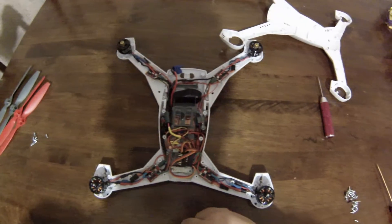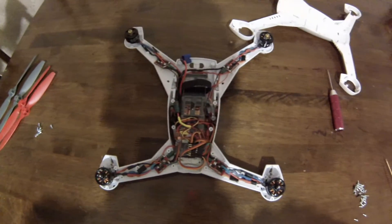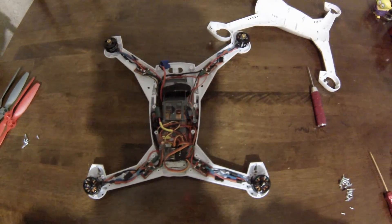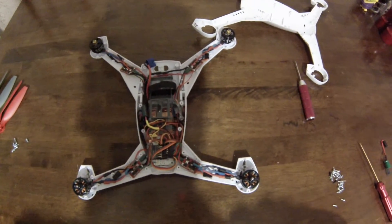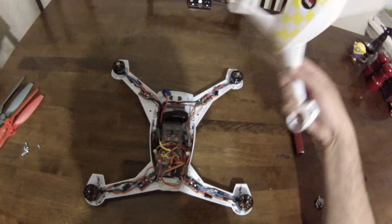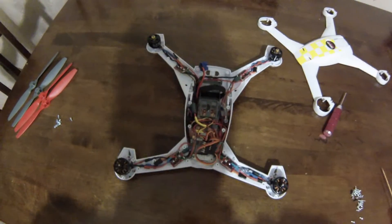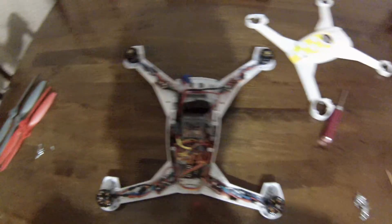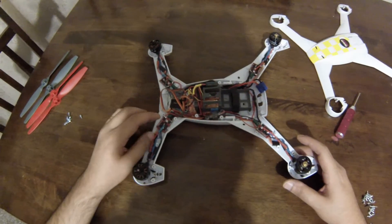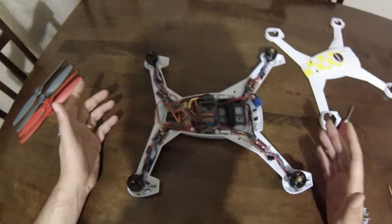Other than that, these are the changes — running the stock battery, everything else the same. She looks the same from outside, but she flies really crazy now thanks to the NAZE32, and pretty smooth on stock settings with nothing changed. The previous original ESCs were rated for 10 amps, so these 12-amp ones do really fine, which they did. I'm amazed how the stock motors perform.